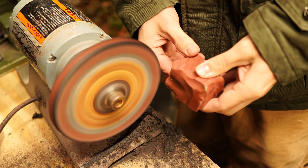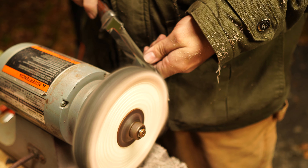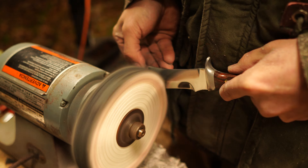With that taken care of, we can move on to the final polishing process. I don't want to risk getting any deeper scratches from any of the previous buffing stages, so I'm going to be moving over to a fresh clean buffing wheel and applying some of this special polishing compound to it. Giving the knife this final polished look takes time — you have to be very careful and go over the entire knife from handle to blade, making sure you're rubbing down any of those tiny little scratches from the previous compounds and giving it a nice even smooth finish.